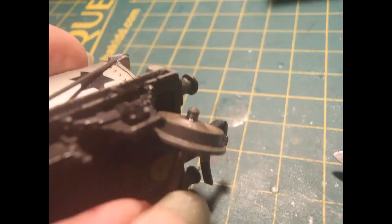I think some of these wagons had seen a lot of use over the years. The ends of the axles tended to have grooves worn in them from turning in the sheet metal bearing pieces, as you can see here.